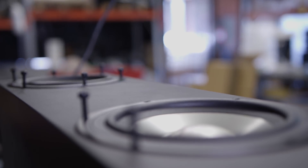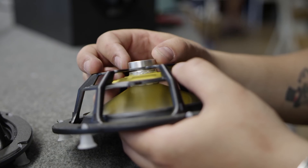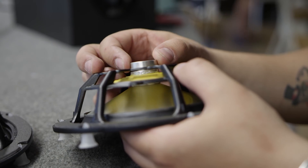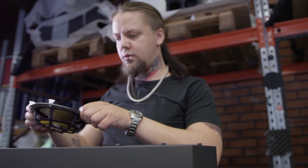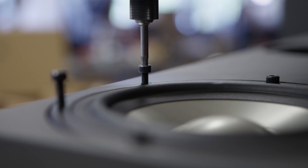You can hear it — it's an 'A' and it's out of pitch. The problem is that mid-range frequencies enter this tube from the rear of the driver, and you're going to have a coloration. If I speak into it, it sounds really bad. But with the passive radiator, you're actually getting rid of this resonance — it doesn't have this problem.